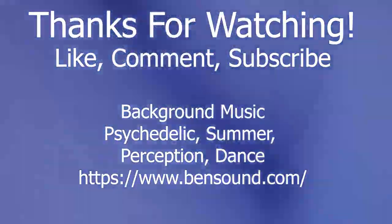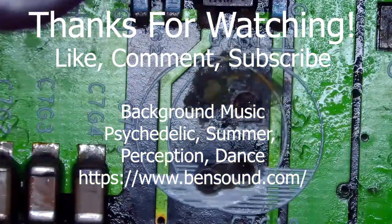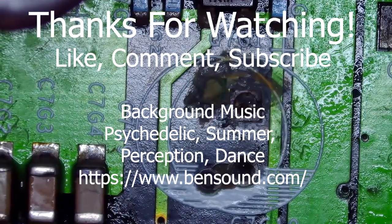I'm also going around other parts of the board just as a precaution to clean up. Otherwise everything seems to be looking pretty good. There's a little bit of residue in the area of the clock capacitor but it's not going to make too much of a difference. I'm going to say this is a good and complete job. At this point I'm going to be putting the motherboard back into the original Xbox and letting it sit for a little while to air dry, and then I'll be starting it up and getting it soft modded.